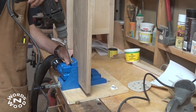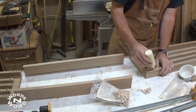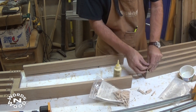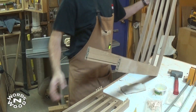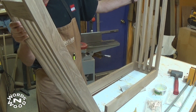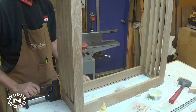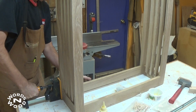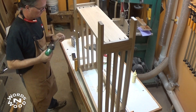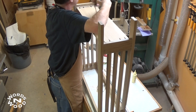These pocket holes are way at the bottom of the unit and they'll never be seen. With four holes at the end of each rail and two rails, that's eight dowels at either end — 16 dowels total. That's a lot of gluing and tiny quarter-inch holes all at once, so things get a little hectic, but it works out. With the top rails in place I can put the shelf in — it's upside down here, so this is the bottom — and they're being attached with pocket hole screws.